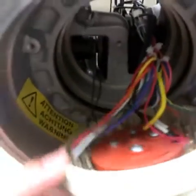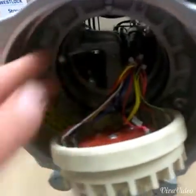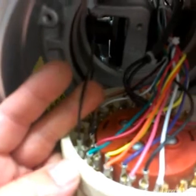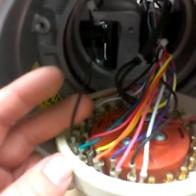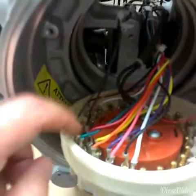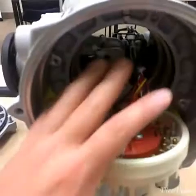Now I'm going to find my two-wire connector loom. Pull it from the front to the back, pull it off of these two terminals, which should be terminals four and five. The wires are labeled, so when you replace this one with the correct voltage, land the correct wires on the correct terminals, then reinstall everything and you're good to go.